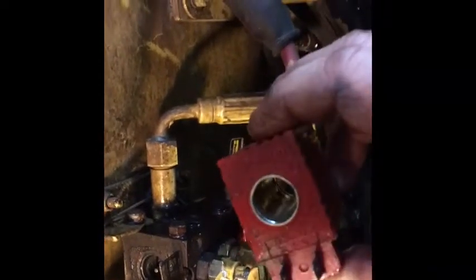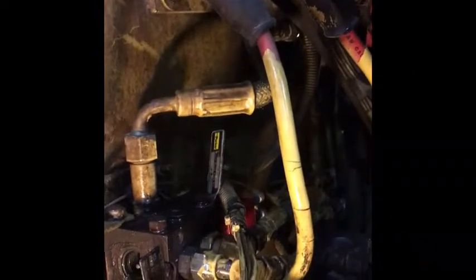I had done all this — taken everything apart and put it back together. I found on a YouTube video that if you have a short between the two prongs, the coil is no good. I was measuring zero resistance on the other coil here, but it still works, so I'm not sure exactly how. It must have enough of a magnetic field to move the pin in these valves back and forth.